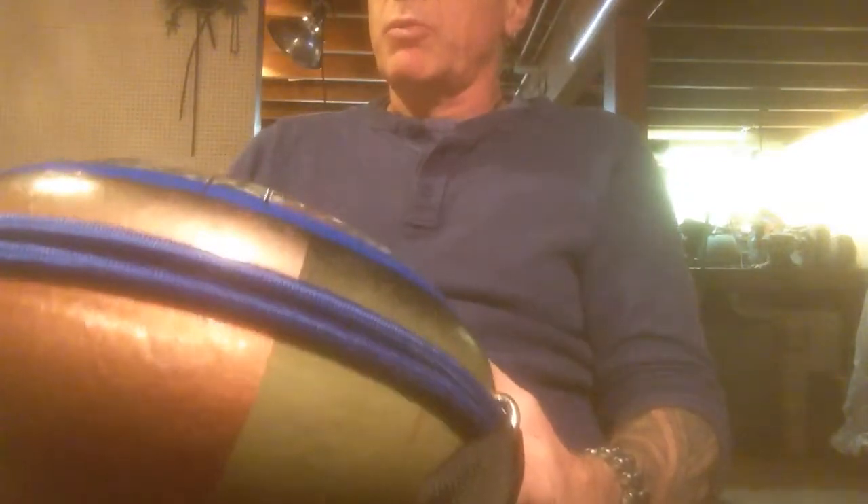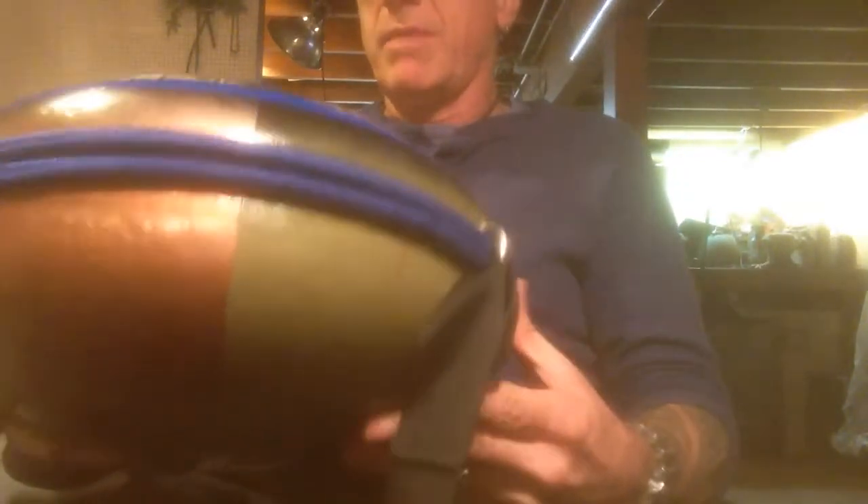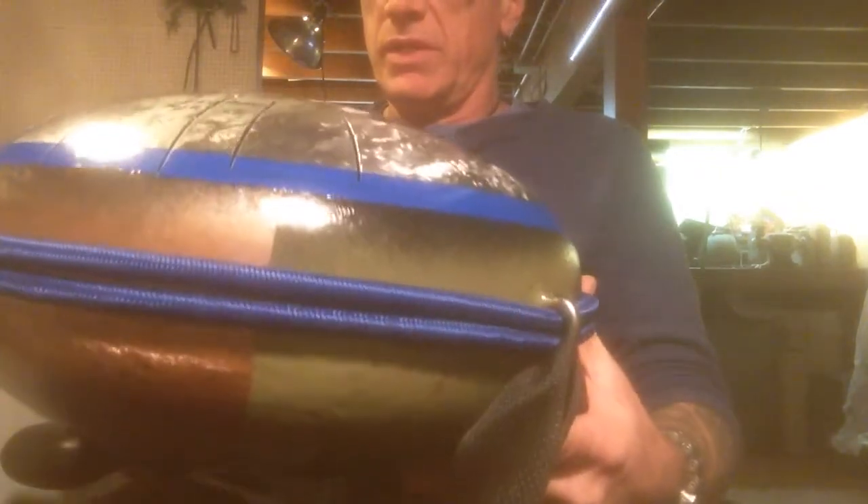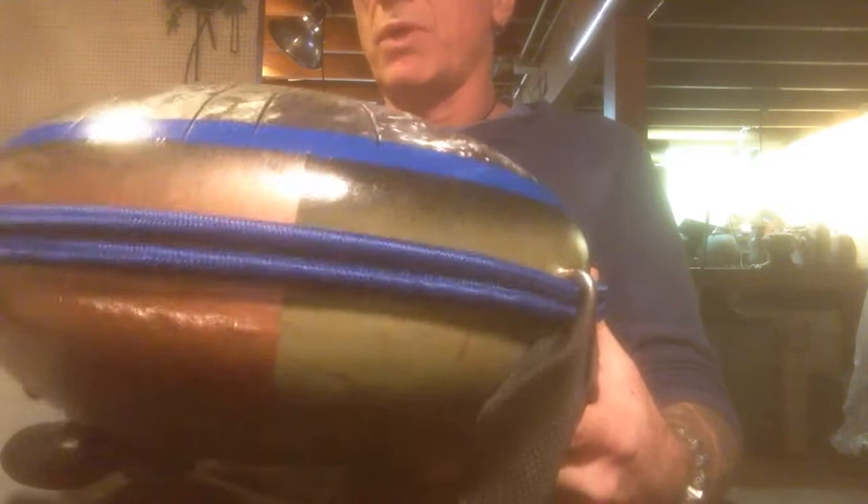So this is the new model. I took a propane tank and cut off the handle on top and the base on the bottom. I cut out the middle 10 inches of the tank and then took the domes from the top and bottom and welded them together.